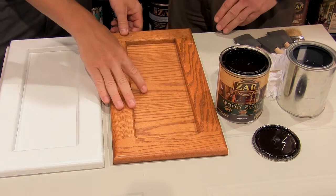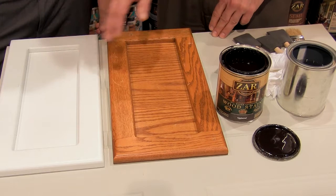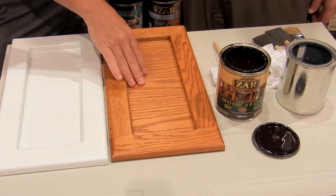How do you decide what color to use? On lighter surfaces like this, you're going to use a darker color stain so you can see the modified tone and let the wood grain pop. On a painted surface, like if it's white like this, you could choose any color you want as long as it's darker so you can see that accent within the panel and the distressed areas. Let's put some stain on one of these doors — this door has been properly cleaned and it's ready to be glazed.